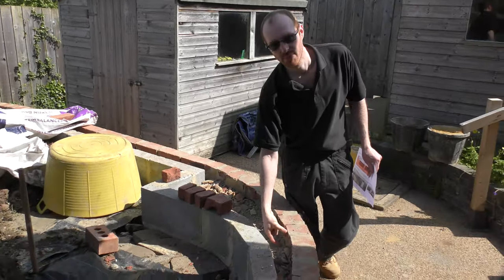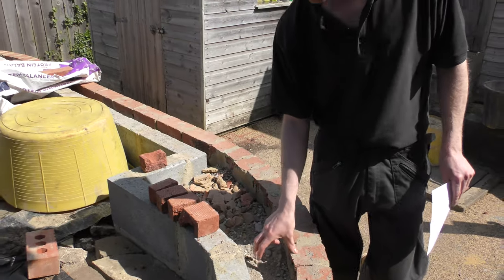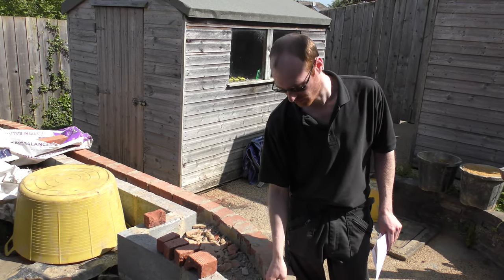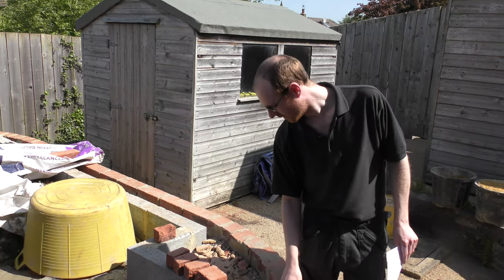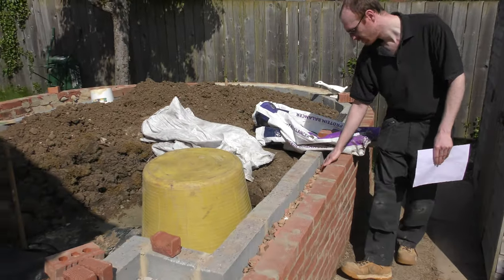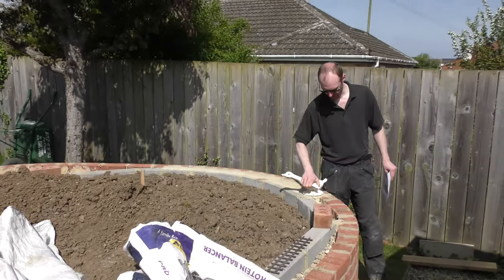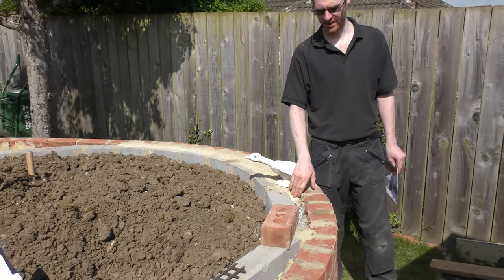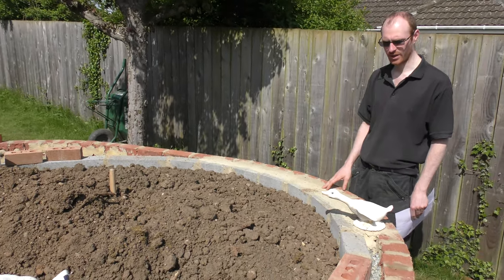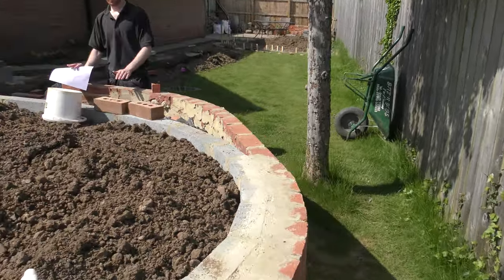We're leaving a good few inches down of infill, and then this will all be concreted in so that when we come to fix the track on - when we drill down into it - it's not going to split apart. We're not going to break the top surface off. There's plenty of depth there for the plug to go into and screw down to, because we are screwing the track down. Same along here - just infill in, ready for concreting, all the way round. This bit we've just put a little bit of cement in because it was only a narrow gap and we had some left over, so this bit's sort of filled. Ready for the track going on. And then if we come down to the steaming-up area.